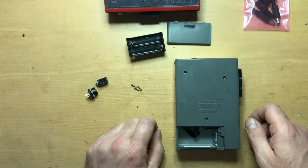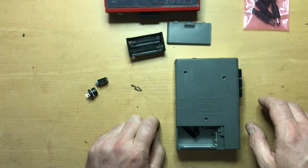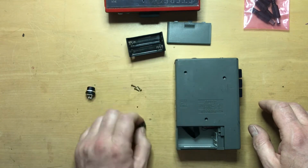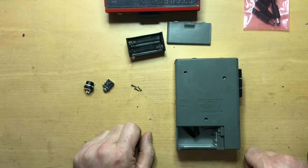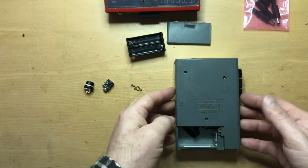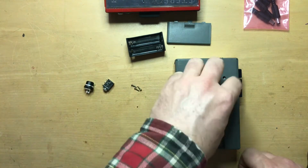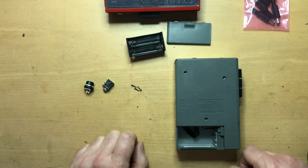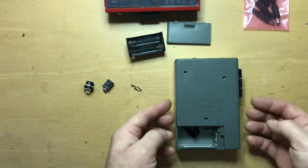There are some tape players that I have opened that it is almost impossible to find a spot in order to put a jack. You would actually have to wire the jack outside of it or create an expansion box. I prefer ones where everything is all built in and you don't have another unit attached to it. So that's the way I like to do it, but I know a lot of people glue a box onto the back of the player, and that's where maybe the speed control or CV motor control is. In this case, like I said, we're doing the DC power for the motor.